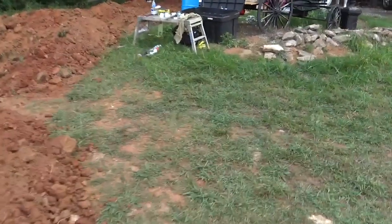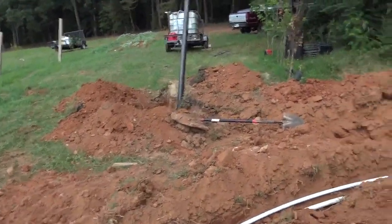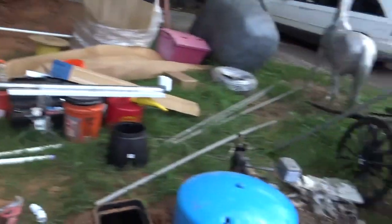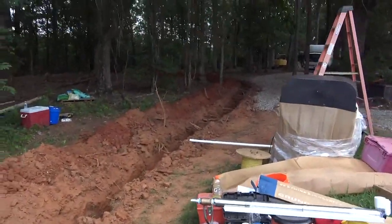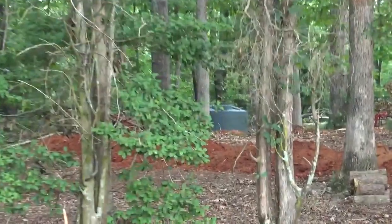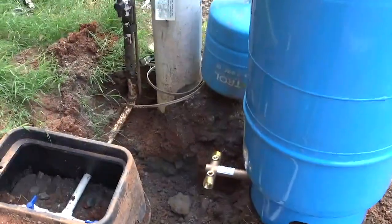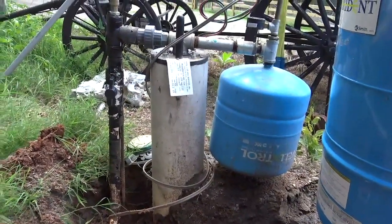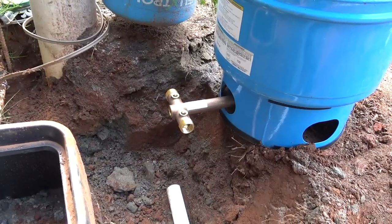We've got an interesting bunch of plumbing to do over here. We've got a four-panel 1,200-watt TPM array and we're going to be running a Grundfos SQ Flex 11SQF-2 pump. We have a tank at the highest point on the property up in the woods — that's going to gravity-feed the whole farm, about 60 acres. We'll tee in here with a master control valve, and I'm going to put two pumps in this well, redoing all the existing constant-pressure pump system.